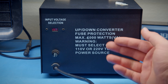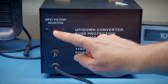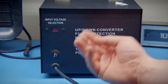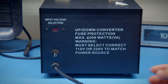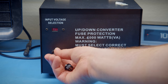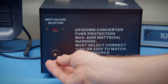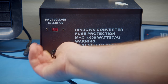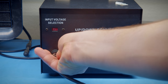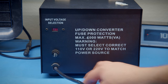On the back we don't have much. There's a big warning telling us to adjust the switch between 220V and 110V. I'm going to leave it on 110V since that's what I'll be using — well 120V, but it doesn't actually matter; 110V, 120V and 220V, 240V are basically the same, power has just gone up a little over the years. There's also a fuse, which looks good — it's a big chunky fuse so that's going to take a lot of power to pop. And then we have the power cable input that I'll be replacing. I kind of wish this hole was big enough for a big IEC 13 connector, but I kind of also need it to be directly wired, so it's probably for the better.